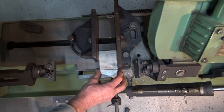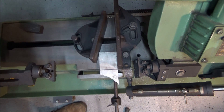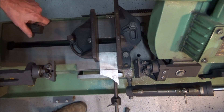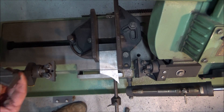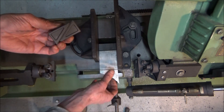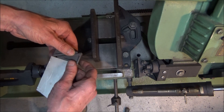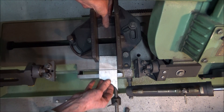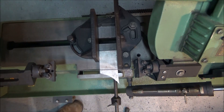I'm going to put my part into the bandsaw vise and it's got to stick off one side. The problem I'm going to have is the vise is going to tip because there's nothing to balance out the load on the other side. One trick I use all the time is using a set of step blocks from the milling machine clamp set. I can just adjust those to about the width of the part I'm cutting, sit them on the other side to balance the load, clamp it down, and I'm ready to make the cut.